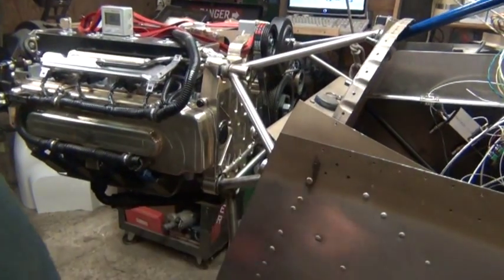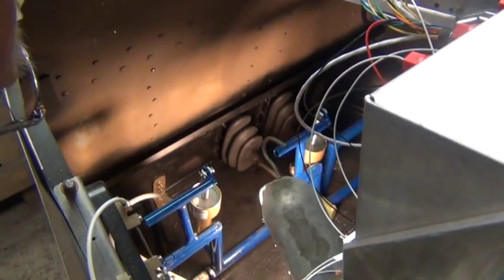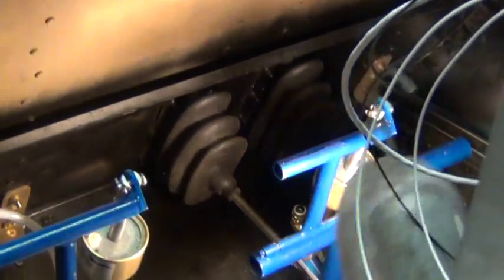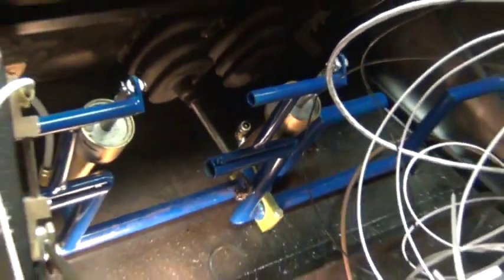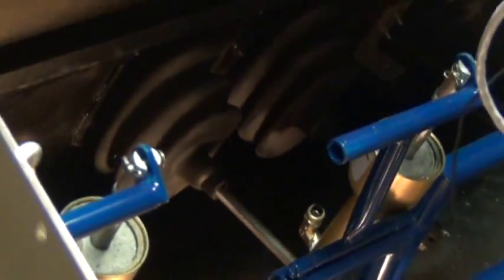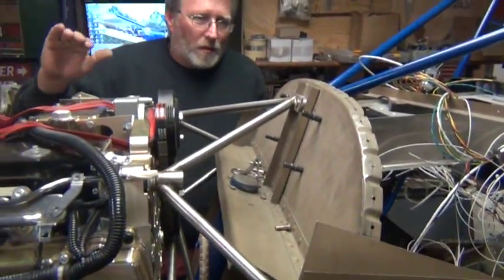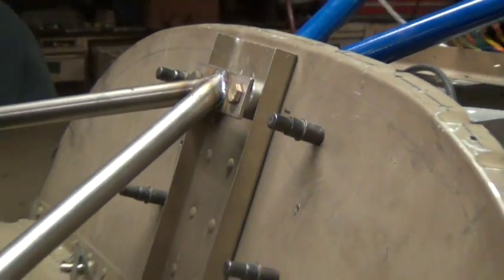I want to show the brackets that I built. You can see where I've built these doubler brackets — it's attached to the 8 degrees, but it ain't no 8 degrees. There's the other bracket over there. The countersunk screws are through the belly longerons, and the lower engine mount bolts are these quarter-inch heads that I've got here. So that's the problem: the engine mount, without the spacers, wants to angle the engine up. Are these spacers acceptable, or should I build or get a whole new mount?